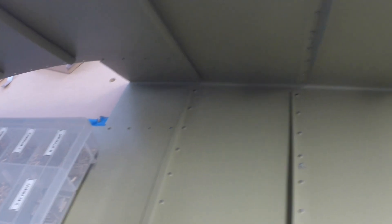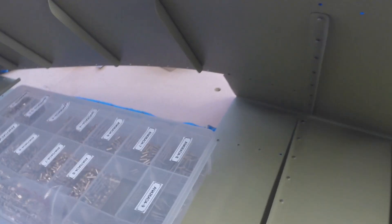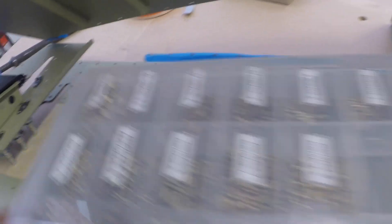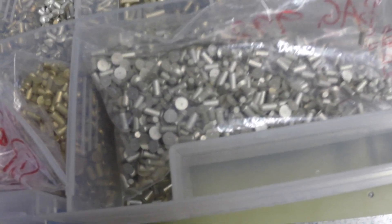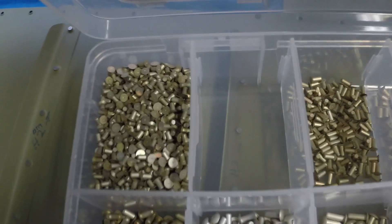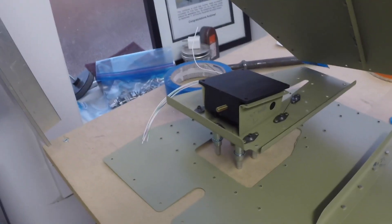This is the same challenge as in my practice flap videos — back riveting is back riveting. It's obviously a little easier with ailerons because you don't have the bend back here; you have a trailing edge wedge to deal with, like on the rudder. This just poses some different challenges. I am also out of AN 426-AD3.5 rivets. I did have some, but they're from an old kit and they're age-hardened, causing cracking, so I don't use them — I'm just going to buy more. If anyone has suggestions for taking care of the rivets in the root of the bend, that would be amazing.